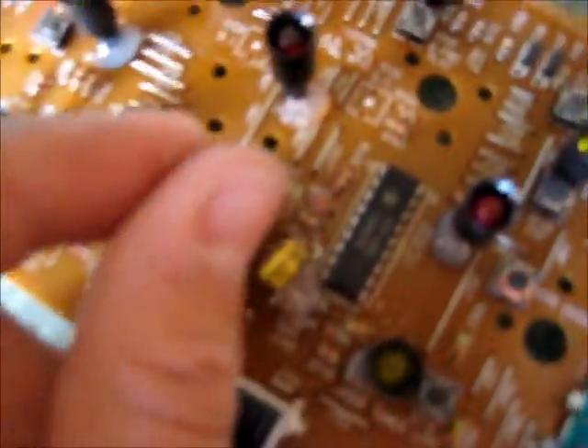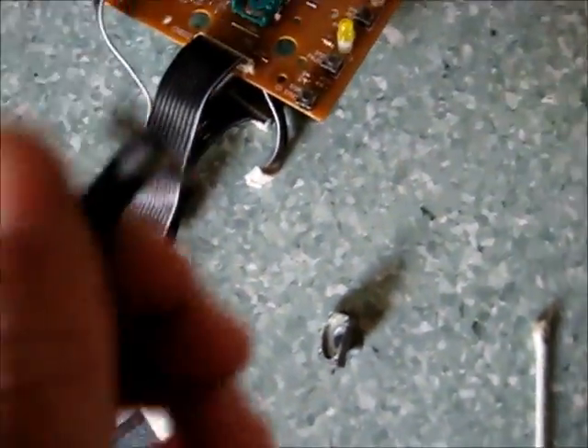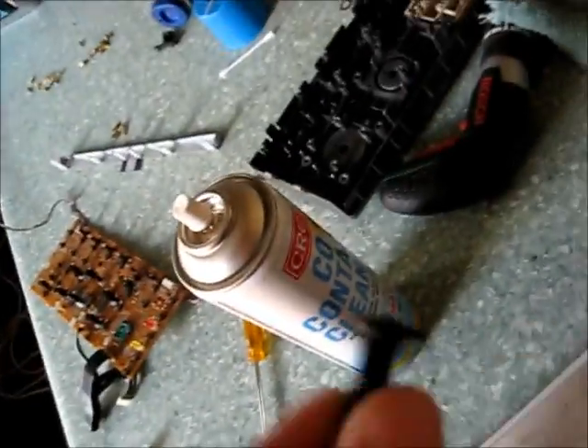I've decided to get a little bit sidetracked. I've actually cleaned the selector wheel — this is just a function selector. This here is actually the volume controller. This one was actually pretty badly dirty — lucky I did this one because the contacts in here are pretty dirty as well. Here's the volume one — works the same way. There's a smooth continuous copper trace on the outer wheel, and there was a sort of muck I cleaned out of it — just the grease and contact residue on it, which shorted it up and blocked up all the traces and stopped this thing from working properly. So I'm going to clean off all the excess grease because it does gum up, makes the volume button hard to turn, and gums up those contactors, causing it to not work at all. Trying to get this grease off, then put it back together and give it a test. Just get a bit of contact cleaner on an earbud and scrub that contact trace clean.